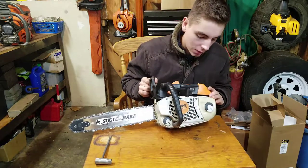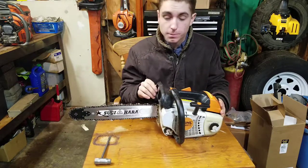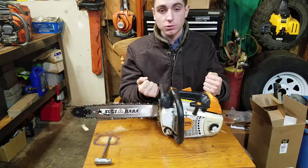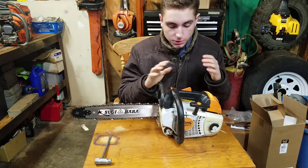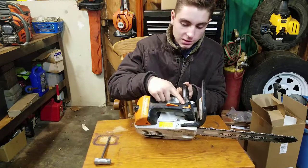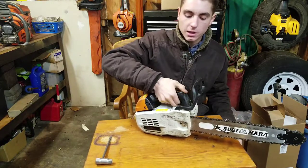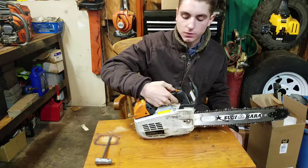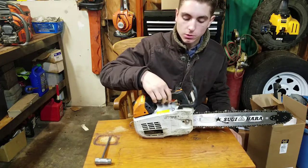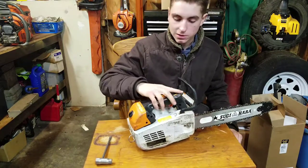But these saws are overall great saws. I prefer to climb with this one personally. My father prefers the T540. The reason I like this one better is it doesn't have the electronic carb, so it's just good to go at all times. It has Stihl's operator lever so you can use one hand to completely control the saw — all the way back is full choke, push forward for half choke, click the throttle for normal run, and push forward to shut it off.